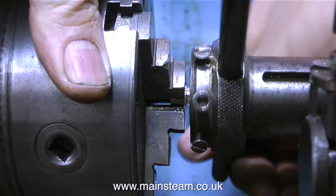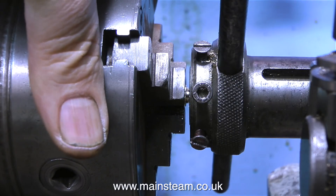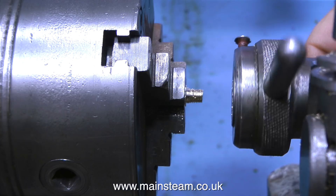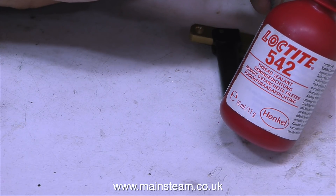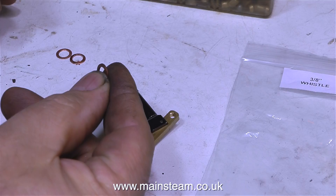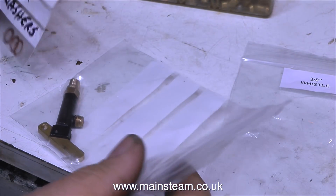I just pick up the selected die holder with the die I need and start cutting the thread. Anything that saves time is very good, because time is something we're all running out of all too quickly — I don't mean to depress you, but it is a fact. I won't expire just yet, so I'll get on with the video. Time now to reassemble the valve with the new adapter. I'm using Loctite 542 to make sure the new adapter doesn't leak. I'm not using 542 on the whistle adapter because the whistle needs to be screwed to the valve after the valve is fitted. You'll notice I've turned off some of the hexagon at the end that goes into the boiler, because the part of the HB6 boiler's turret where this will fit is recessed. I'm supplying some shim washers with this valve, so all the customer has to do is use the correct combination of shim washers to make sure that the whistle ends up at the top.